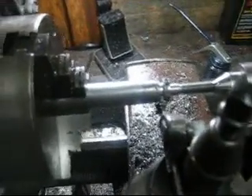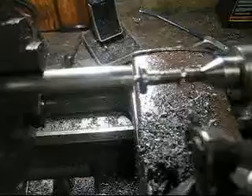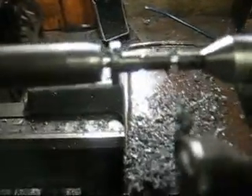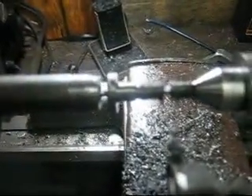The lathe just locked up - I was going too fast. I'll shut this off and take stock of what I'm doing. I've got maybe a sixteenth of an inch left, so I'm just going to cut it off with a hacksaw rather than take a chance on it hanging and tweaking something. Then I'll put a little grinding on it. There we go - my old broken bolt and my new finished one.